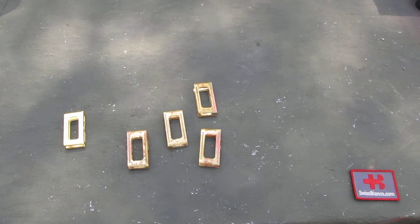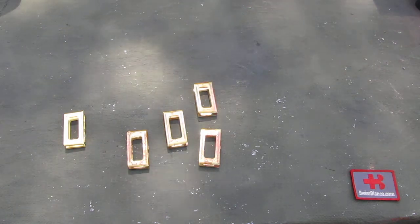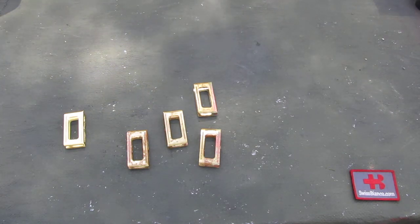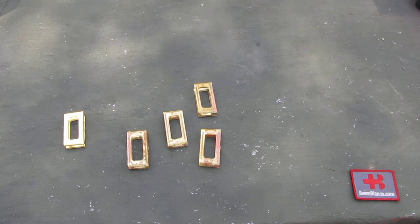You simply put your brass objects in the container and let them sit. If you have a clear container, that's better so you can see through and watch how it ages. You need to look at it and say when enough is enough. Then take it out and wash it off with soap and water so the chemical process is stopped. It's easy and doesn't cost much.